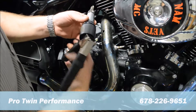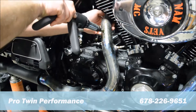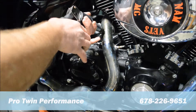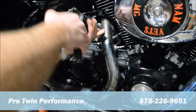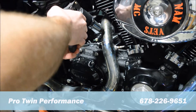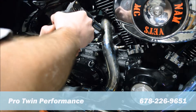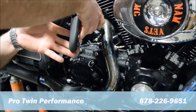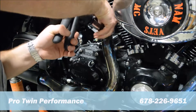Then we're going to take a hydraulic rivet gun with a swedge rivet and press it into the hole. Pull the trigger. This is a hydraulic rivet gun — it puts in quite a bit of force, but there'll be a fairly positive stop once the rivet's collapsed entirely. Once you have the rivet collapsed, press the button on the bottom to release the rivet gun and unthread it.